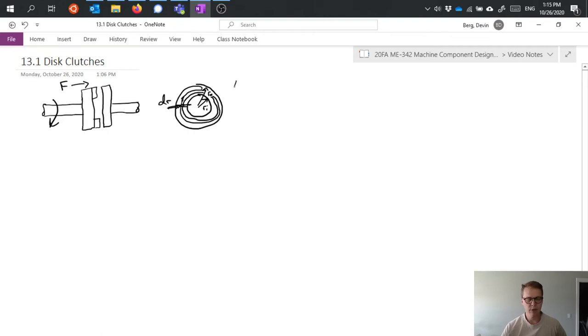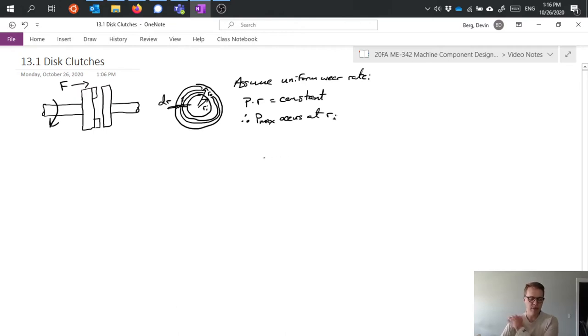And an assumption we're going to make is a uniform wear rate. So we're going to assume that the entire range of radius from Ri to Ro wears at the same rate, which means that we can expect a pressure differential as we move out, because what this is saying is that pressure times radius is a constant, due to the different rotational speed and such from the inside to the outside. So if pressure times radius is constant, that means that the max pressure occurs at the inner radius. And this is useful to us because we can then use that as a known point when we look at our differentially sized piece of material here that I'm trying to shade